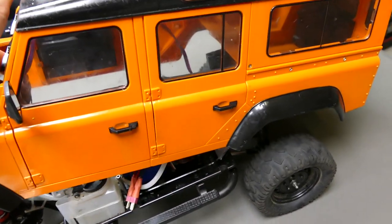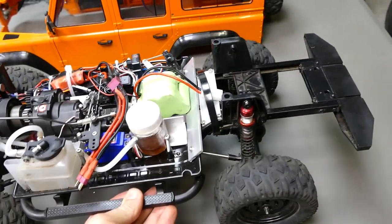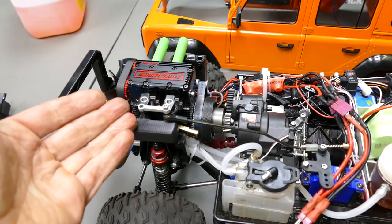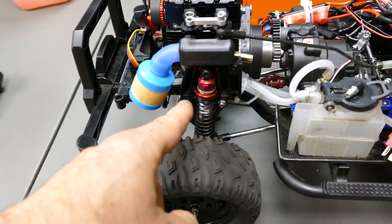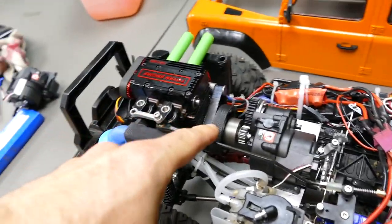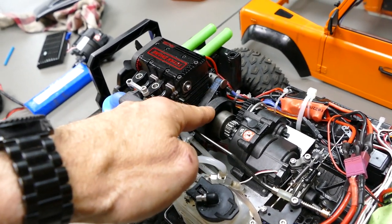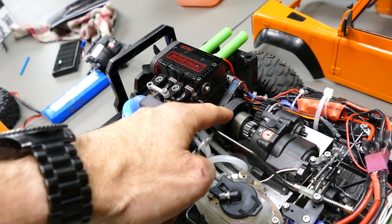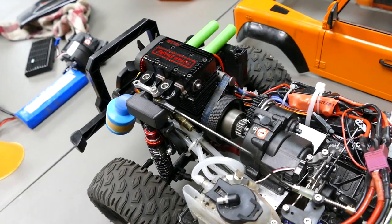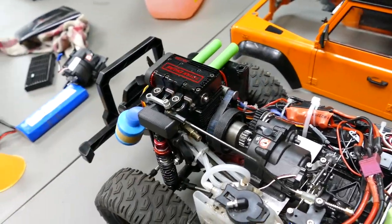Let's take off this body. It does come with lights as well if you're into that. Now, as I explained a bit in the previous video — two cylinder, attached via a little aluminium plate screwed through the C-channel chassis, which is all metal. It's got so much room. When you buy the engine it comes with the flywheel installed, but there's no clutch — you need to get that separately. It does come with the holes for the pins; I've press-fitted some pins for the clutch and installed a clutch bell. So that doesn't come included when you buy the kit.